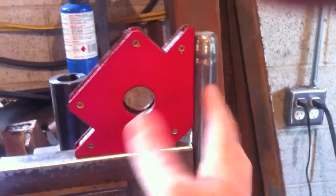So over here, this is the three-point hitch laying down. What I did was I welded that 4x4 piece of steel on there to give me some reach. And on that 4x4 piece of steel I'm going to put a round receiver. I've got it sitting around here somewhere. Into that round receiver, this pin right here will go, and that will allow me to pivot around with that pin.